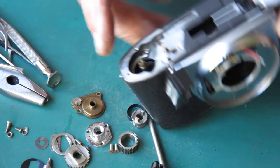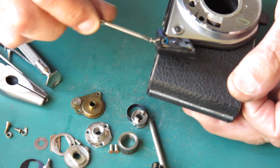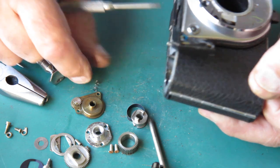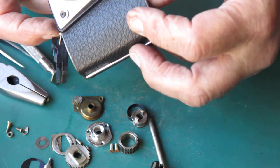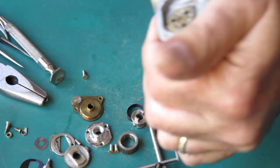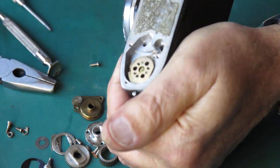The screw here on the top of the release lever — we'll get that off — or the shaft for the release lever. That's got a return spring there. Put that aside. And I'll drop that release lever out the base of the camera. Of course that's got a little spring on the arm of that.